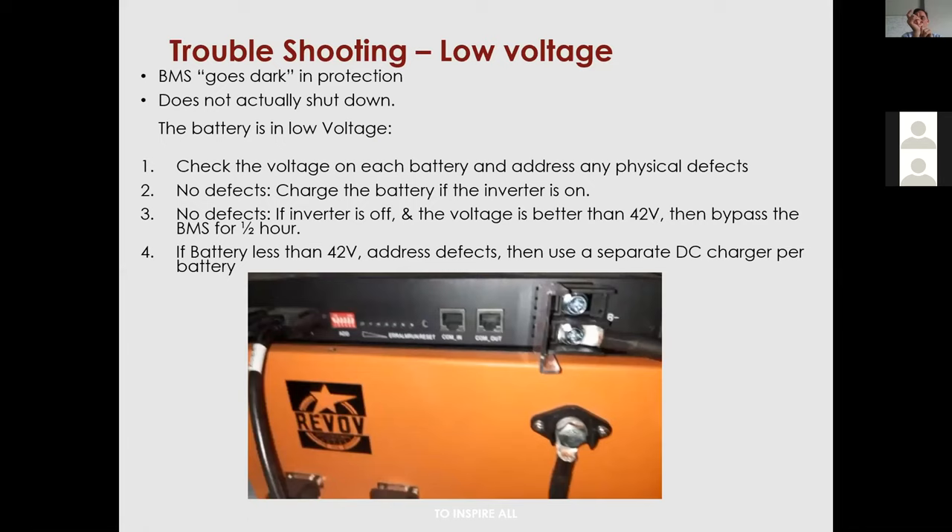After the startup sequence, the lights go all green, then you should see two green LEDs remaining on, indicating approximately 50% state of charge and confirming the system is on. In the fault case shown, the sequence completed but no charge indicator appeared — the system went off. So: reset button right-to-left means turning off; left-to-right means turning on. If it was in sleep mode and you push the button, you'll see right-to-left, confirming it was in sleep.